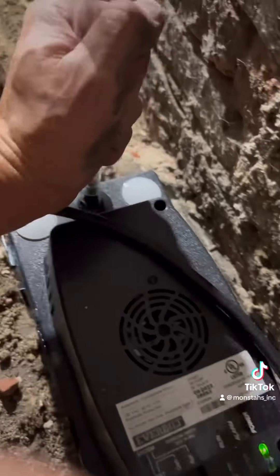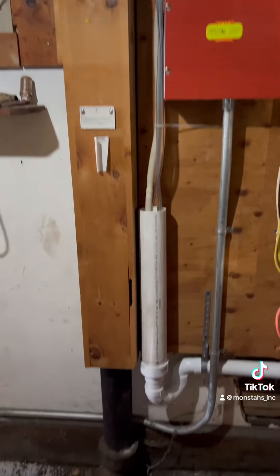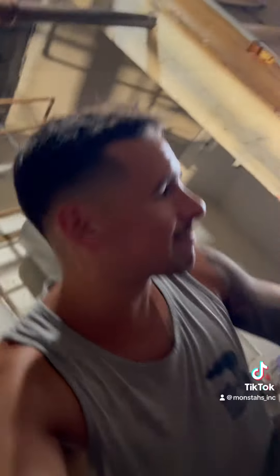I'm going to do an inch-and-a-half by three-quarter coupling into the pump with two-and-a-half-inch standpipes so that way the hoses fit in there right — across the room and down. And that's it, it's done.